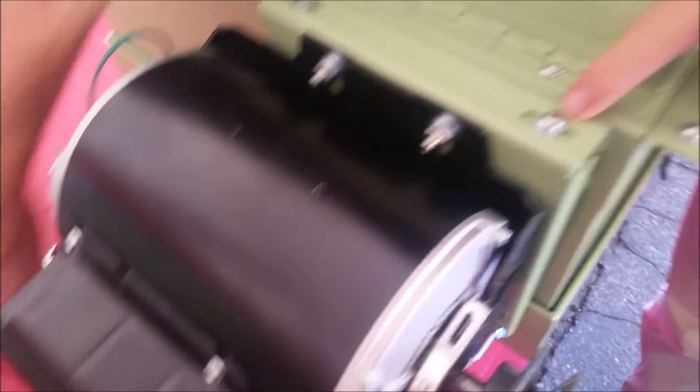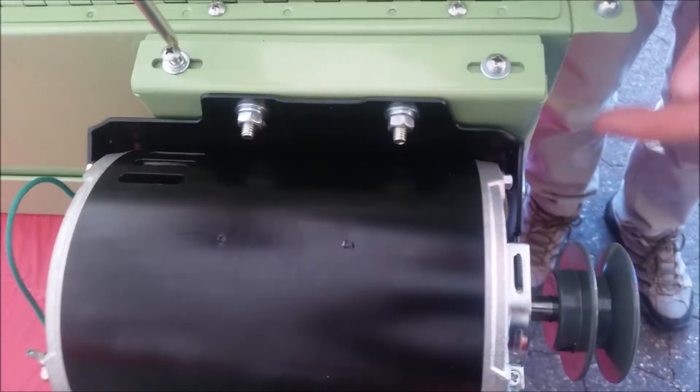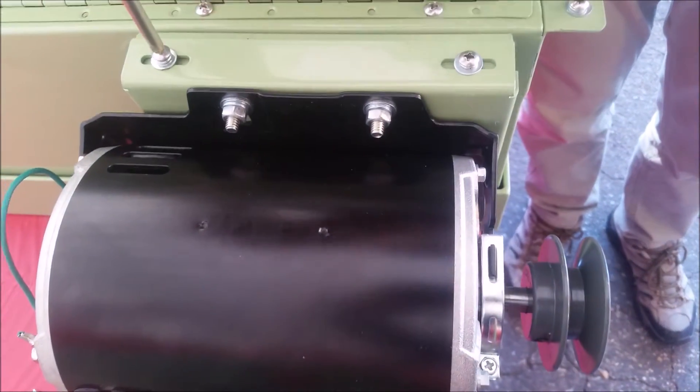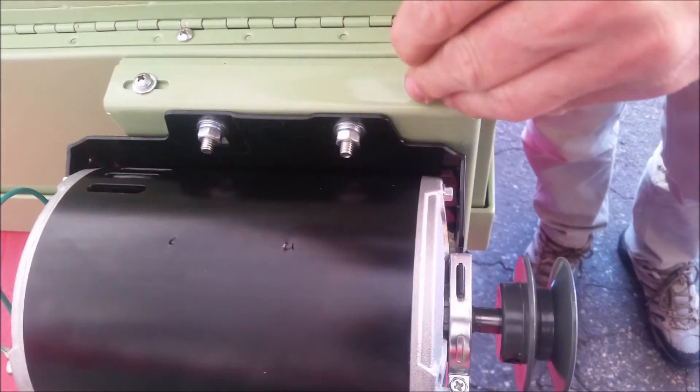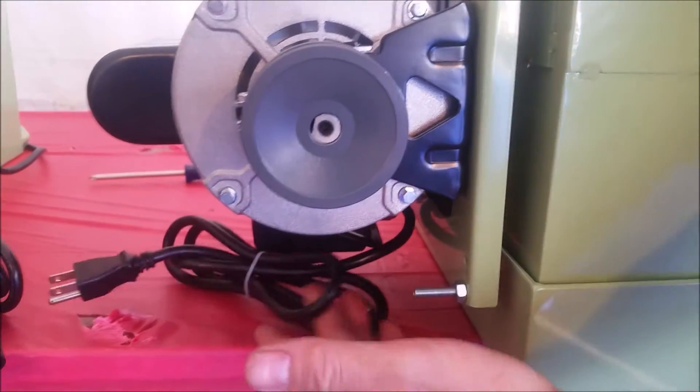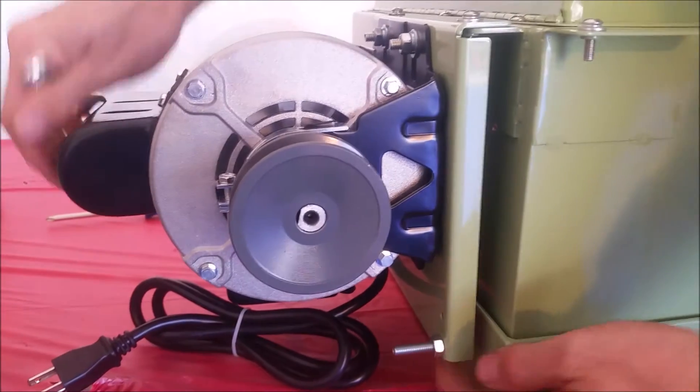You'll see that I've put the screws just about in the center, which is the default — we ship the pulley so it should be pretty well aligned. I tighten these screws up here, and then next what I'm going to do — you see these two bolts down here that stick out of the motor plate — these are used to lift the motor and set your belt tension.